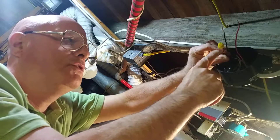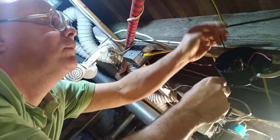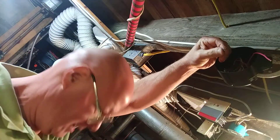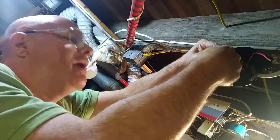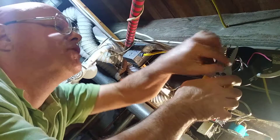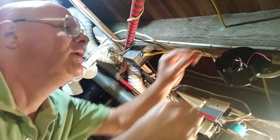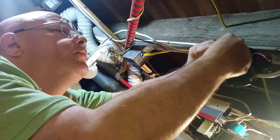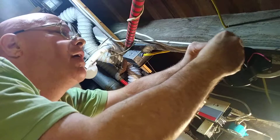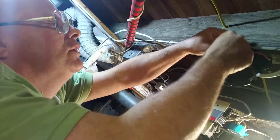The grounds get wire nutted together. Now if there was a ground on the light fixture, you'd tail from this to the light fixture. Now the black is going to be the live — this black is going to be going to the switch, and these wires will be wire nutted together. We will wire nut these two black wires together; you've got to get the insulation even at the bottom and copper even at the top.